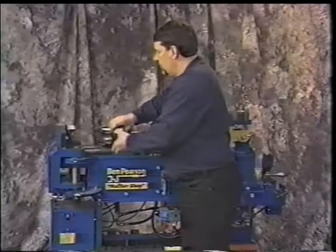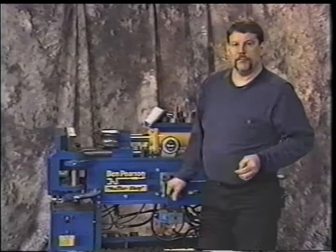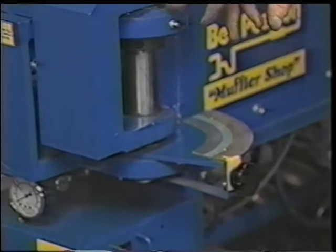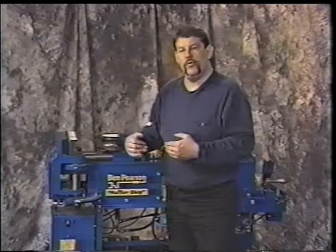Smooth operation, smooth tubing. Anytime you get any gouges or whatever, it could cut or tear the tubing if it's severe. Okay? And then on the back gates, it shows that there are grease zerts here and there's one underneath. You want to make sure and grease those weekly. You don't have to put a lot of grease, just so a little bit flows out in the bottom of this back gate. Keeps that operation nice and smooth and also that it doesn't get sloppy on these back gates.